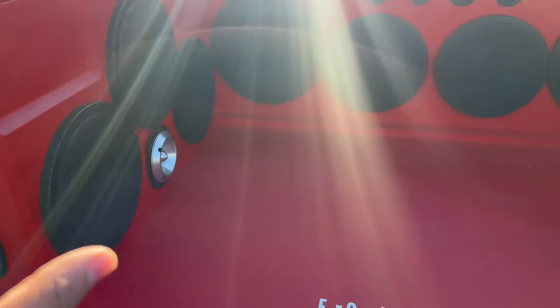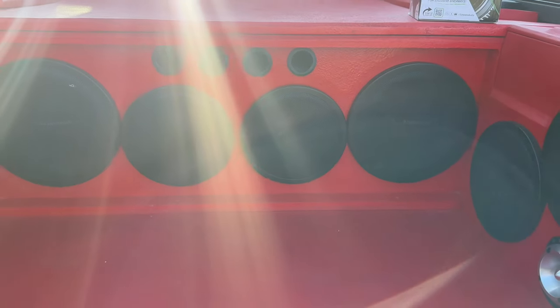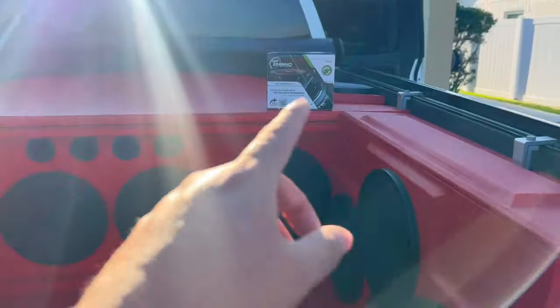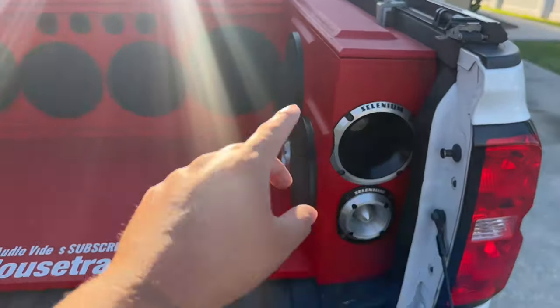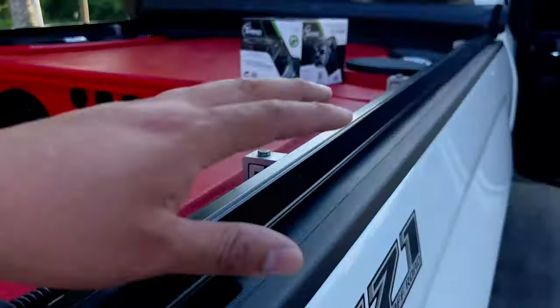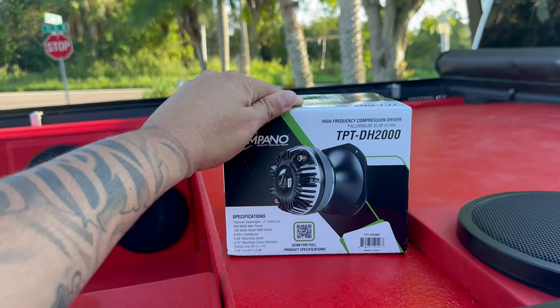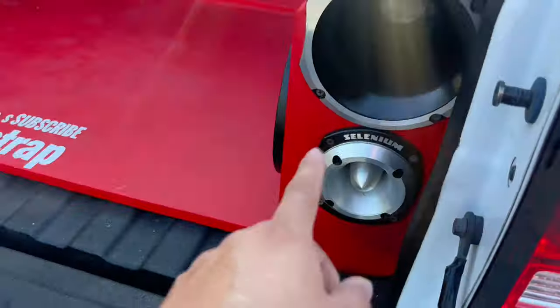I want to put a Tympano horn with a longer throat so it does long-distance sound projection. Up close, those Tympano horns are dangerous — aggressive with the right power. The shorter-throat ones do the job up close, but the longer-throat ones throw the voice a long distance. I'd like to get Tympano mid-range speakers — probably do all six tens as mid-range, two tens in the center as mid-bass, and mid-range on the 12s as well. With ten to twelve horns, I'd want at least a 3000-watt amp on them so that thing is screaming.